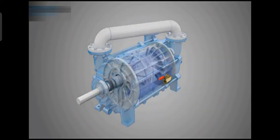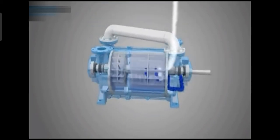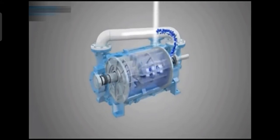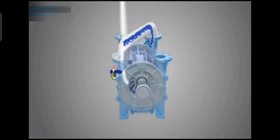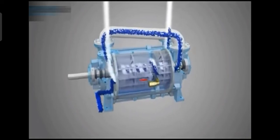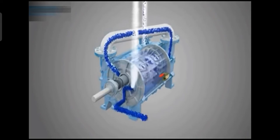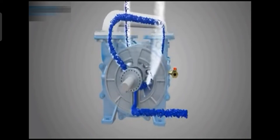The KLRC is a non-pulsating vacuum pump designed to remove gases through the use of its rotating impeller blades that enter and leave a ring of liquid. The impeller forces this sealing liquid to the periphery of the pump casing. Here it forms a ring of liquid around a center void. The impeller shaft is mounted above the center line of the casing. The blades, although rotating concentrically, are located eccentrically with respect to the casing and to the ring of liquid.